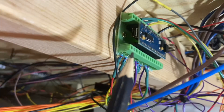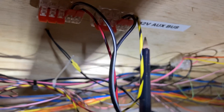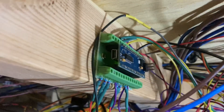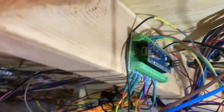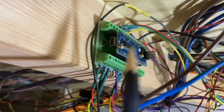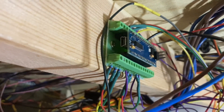I'm running this one off my 12-volt bus that runs around the layout, and I'm using that as the power supply to the Arduino. You could use a plug-in USB which only needs five volts, but if you're using the voltage-in — which is what I'm doing here — the voltage in needs to be between six and 12 volts, and the Arduino takes care of bringing it down to five volts.